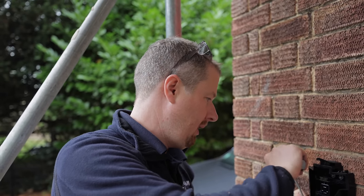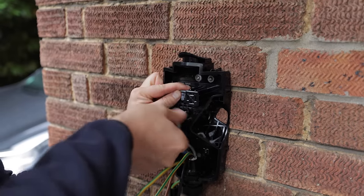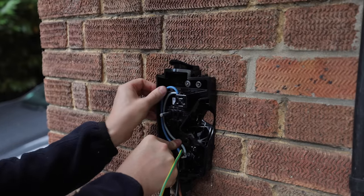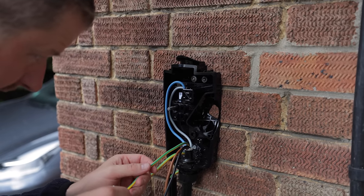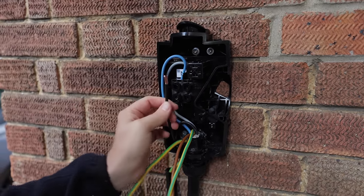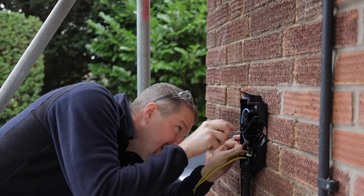I've finally got the cable terminated into the enclosure. Now the easy part — connecting the wires. As it's three-phase we've got L1, L2, and L3. Grey is L3, neutral is blue, and they do give you lots of space in here compared to the old one. L2 is black — just tuck a little bit of slack and shorten that slightly.